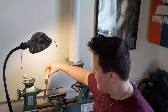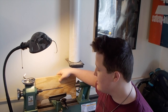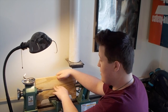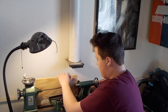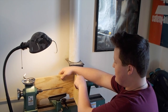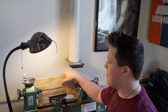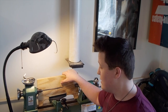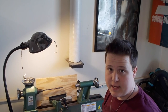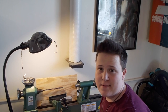I just came here to test fit everything and the side pieces work out great. I went ahead and put on the back, and here's where I had the stunning realization that this is the shortest piece I can ever turn on this lathe if I stick with this length of a back. The problem is the tailstock cannot move into this area even when the sides are installed. I suppose you could come up with some complicated way to make this adjustable, but I don't really have a lot of time right now, and I don't really do anything other than pen turning on this lathe.